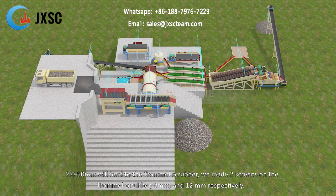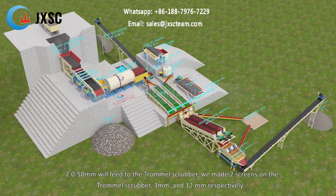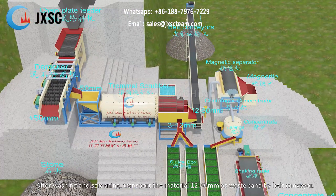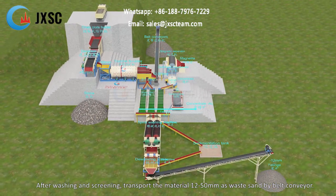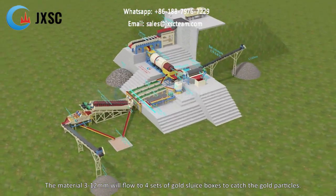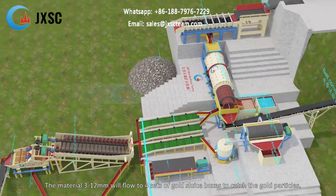2. The 0 to 50 mm material will feed to the trommel scrubber. We made 2 screens on the trommel scrubber, 3 mm and 12 mm respectively. After washing and screening, transport the 12 to 50 mm material as waste sand by belt conveyor. The 3 to 12 mm material will flow to 4 sets of gold sluice boxes to catch the gold particles.